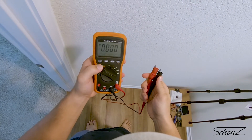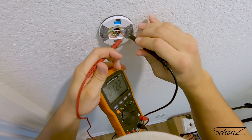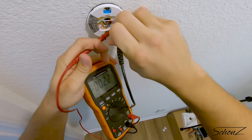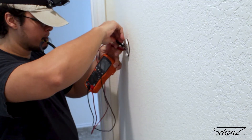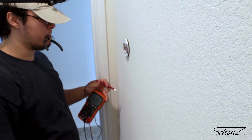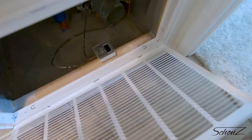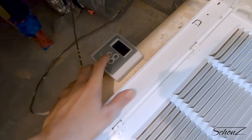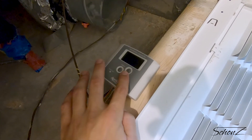Okay, I know what to do — let's get the multimeter out. So there's no power here. I definitely turned the breaker back on, so let's go look at the other controller plugged into the air handler. Under the handler I have a controller that opens a vent every hour to let fresh air into the house — and we can see that this doesn't have power either.